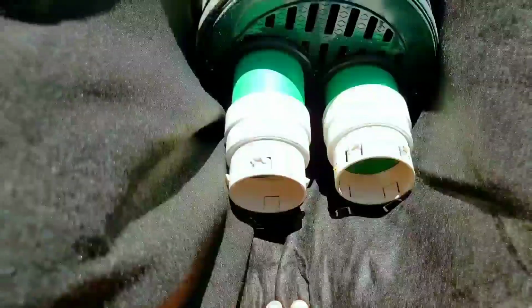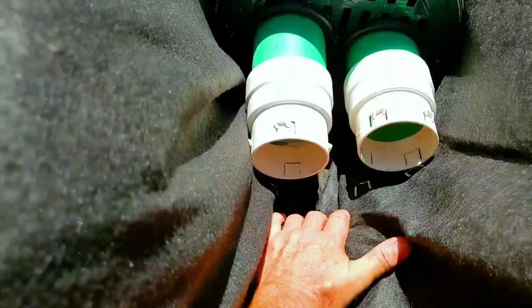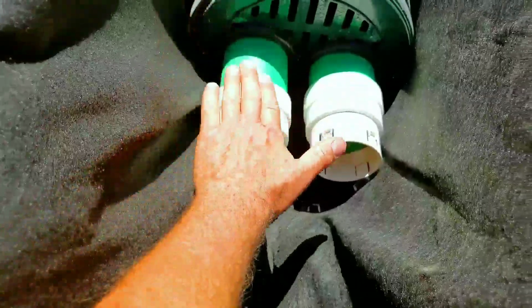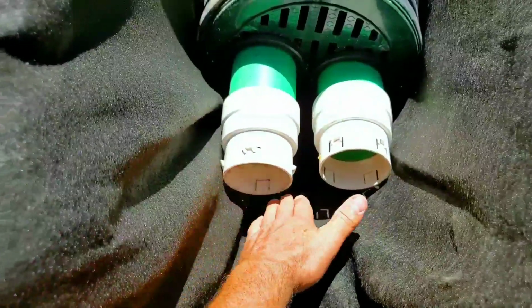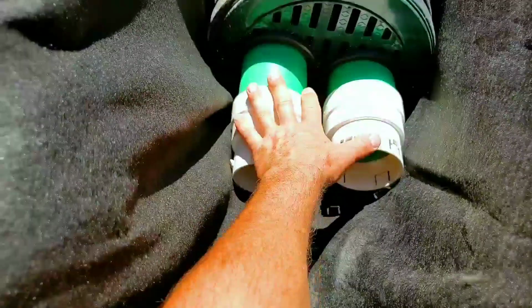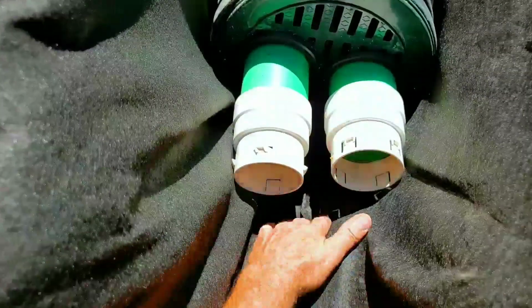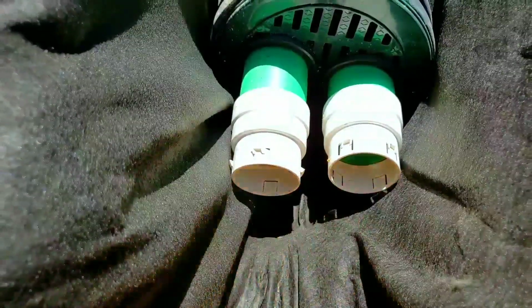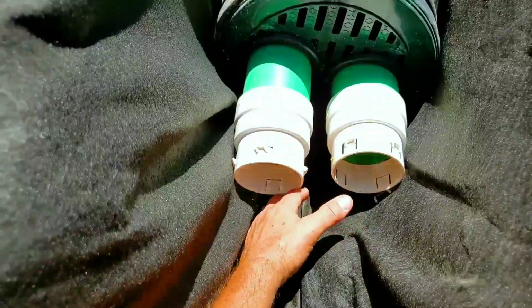It's really, really important that right here, see how this, so what they did is they dug the sump pit out deeper, and there's a step there. There's a step where this drops in, so we can empty the trench. All the water has no problem on a 3% slope falling into the sump pit.